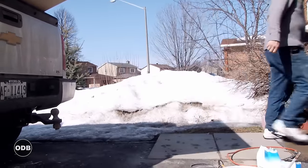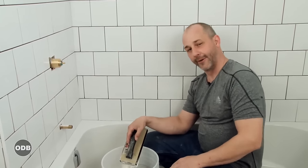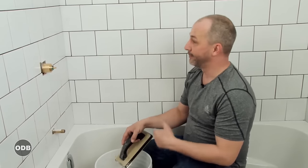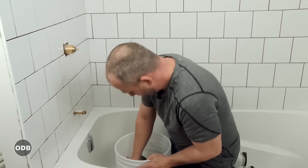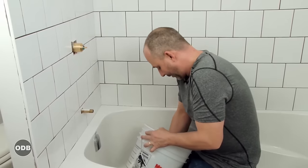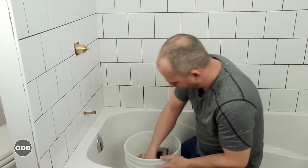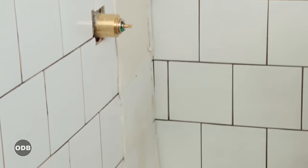With standard grout you have about 20 to 30 minutes to apply it, and then within an hour or so to wash it all off — so that's plenty of time, we're not rushed. For technique, you can see how sloppy it is — it's still firm but not easy to manage. I like to start at the bottom and then lie it up the wall.